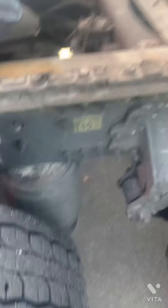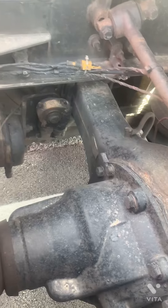And our little bracket. On the Volvos we have a rear spring shackle — it's got two grease fittings on the knee side. Then there's also a nipple for the clutch throwout. Unfortunately I can't get far enough under my truck without having ramps under it, so that one I only do when I am doing the oil change at home. And the back axle is gonna be similar to the front — we're gonna have a grease fitting on top of the slack adjuster and on the S-cam. And that's really the only thing on these Volvos as far as chassis that needs grease.